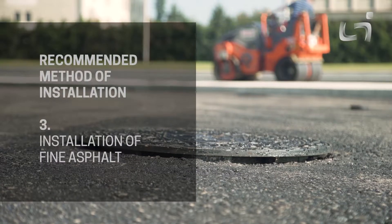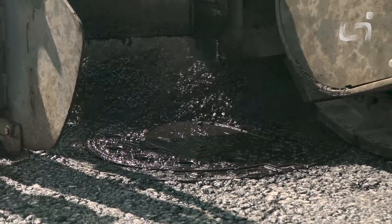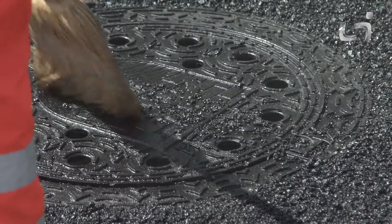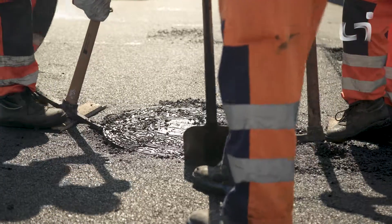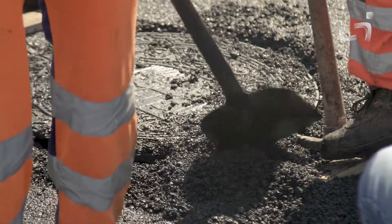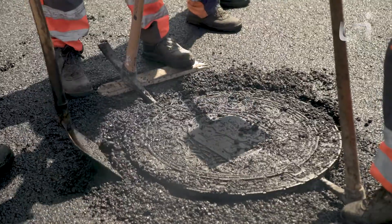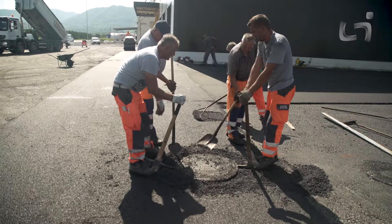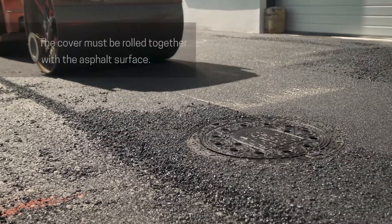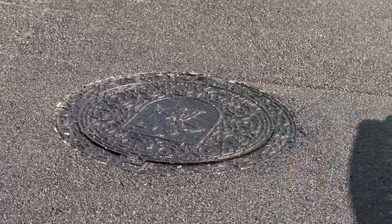The application of fine asphalt follows, which is carried out with a lowered cover frame. The applied fine asphalt is then removed from the cover. The cover frame is lifted during leveling using a manual tool, followed by accurate backfilling under the frame flange. The material around and under the cover flange is then appropriately canted so that the asphalt surface may be leveled with the road during rolling. The final position of the cover is ensured by rolling over the entire frame surface.